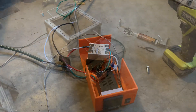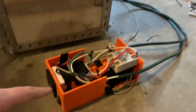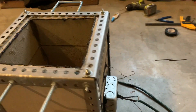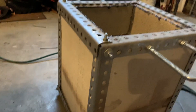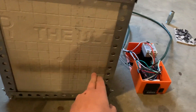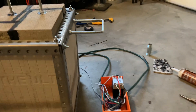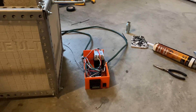All the electronics are tidied up down here, and the thermocouple is in the furnace. All that's left is to paint the logo and put the lid on. I've turned this on before, as you can tell by the burn marks on the cement board, so I don't think attaching all the electronics to the side of the kiln is a great idea — it would probably melt the plastic or ruin the electronics.